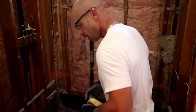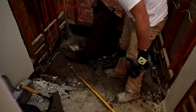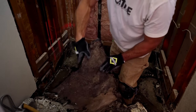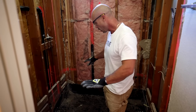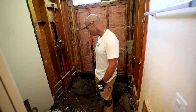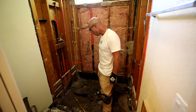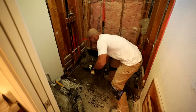Under the shower it's all wet - this is all moisture that came from the outside of the shower and crept in. All this concrete is wet. Here's dry concrete - that's what it's supposed to look like. The water wicked over the curb and into the slope board that was the pre-slope for the hot mop. If this was a wood subfloor you would have had water damage in the substrate below - you'd be replacing three-quarter inch plywood subfloor or OSB, and the joists below could even be damaged. Luckily this was a slab foundation.